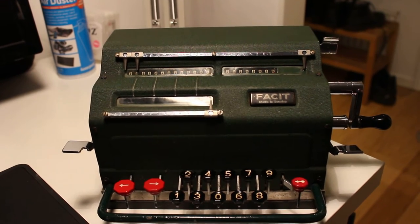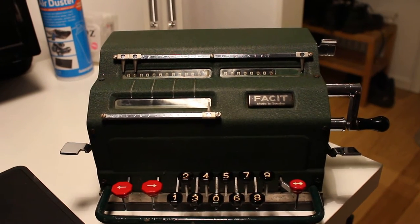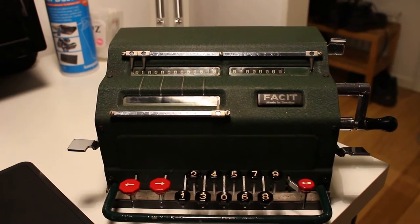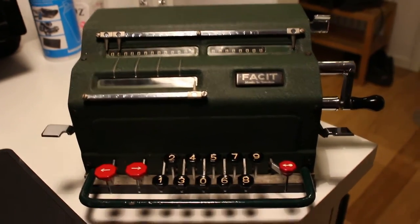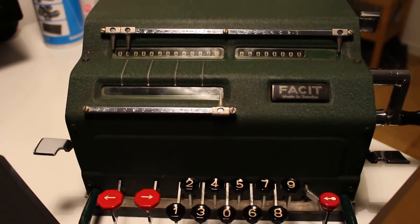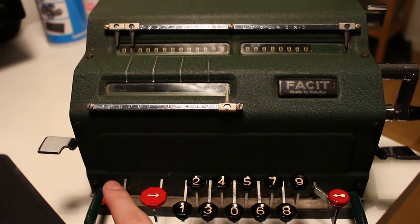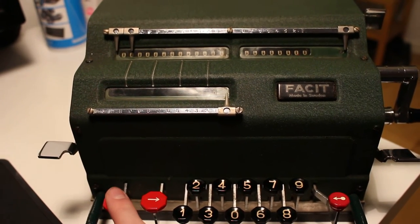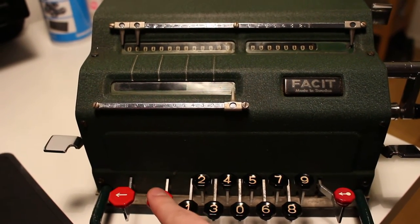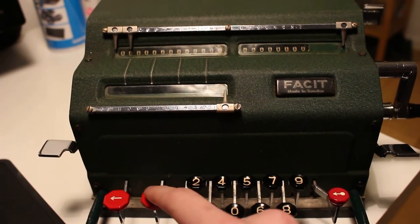The setting keys cause some pins to extend on the rotors, which then connect with the accumulator registers. The components include the carriage step buttons, which move the carriage in either direction. This one is spring powered, so when I push this button it will release the spring and it will jump to the left — very light push required. This one is slightly harder because shifting to the right also recharges the spring.